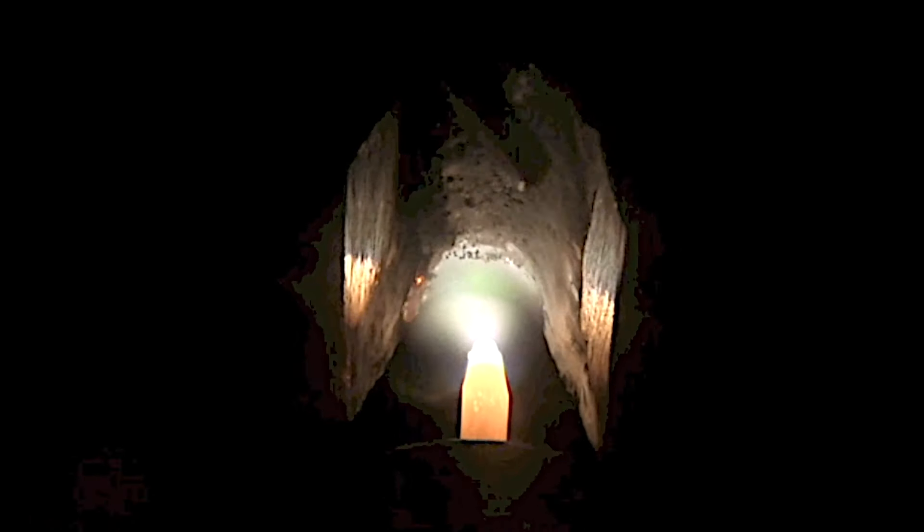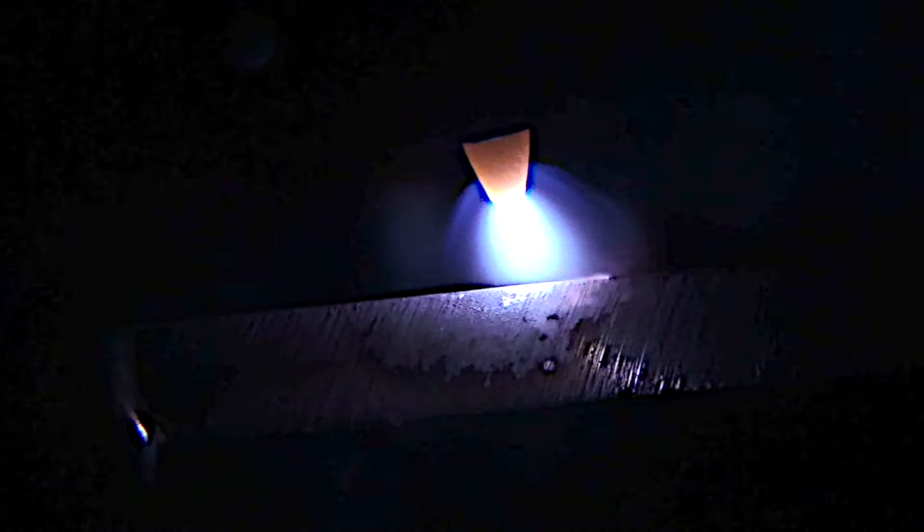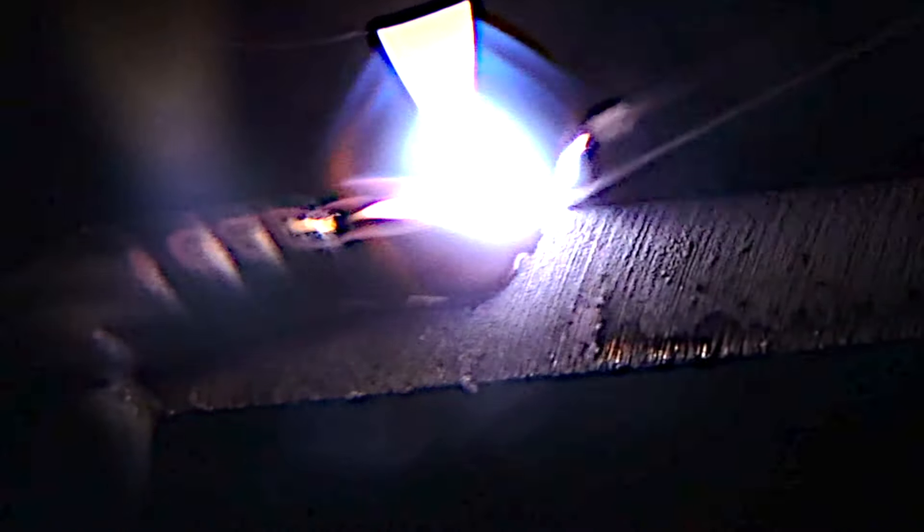It takes a little patience but it's worth it. If you puddle too quickly on castings you get a lot of scum in the puddle. Think along the lines of brazing — you're flowing metal over the surface, not really trying to melt anything below, and to do that you want to let that cleaning action walk and work. Here's another example on the edge of a machined casting — still got a lot of crud in it. I'm letting that cleaning action work and bake some of that stuff out before I ever puddle, then once I puddle I go nice and slow so I don't outrun the cleaning action, which keeps a nice clean shiny puddle.